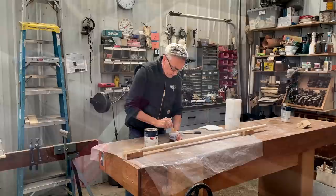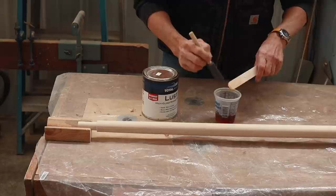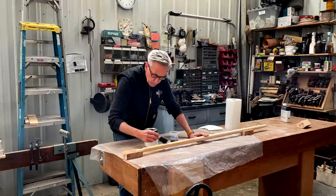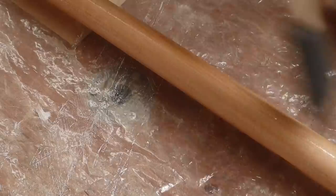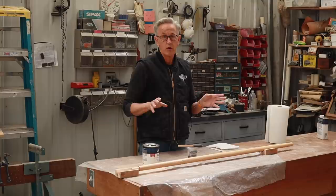I'm going to get a little varnish on here. I'm using Total Boat Lust, and I've mixed it 50-50 with thinner, which is what you should do on fresh wood. This is really some pretty wood — I'm quite surprised at how much figuring there actually is in it; I didn't expect that from the spruce. I'm going to get several coats on both of the spars, and in between I'm going to sand lightly so that I build up a really nice finish on both of them.